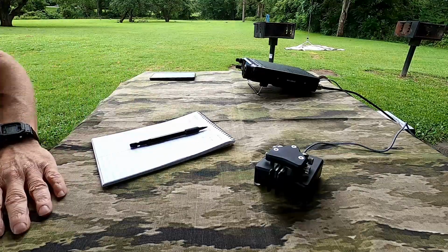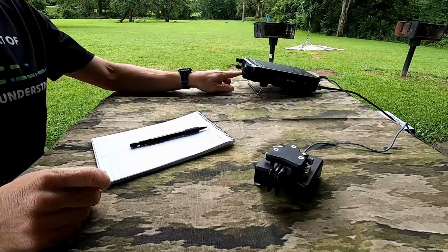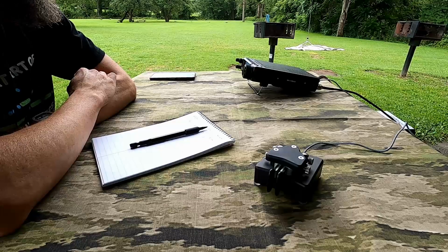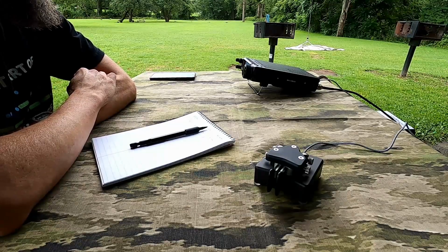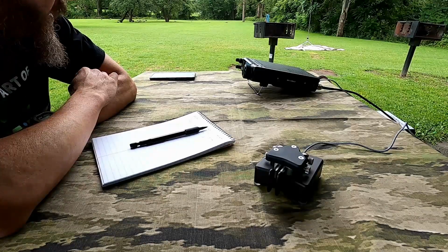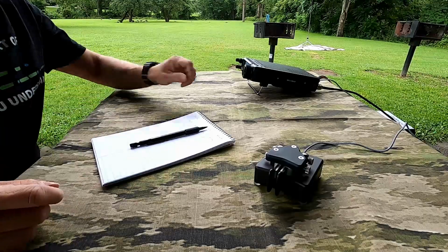Hopefully you can hear everything. Yeah, my SWR is about a 1.1 to 1 right now, and it was 1.6 to 1. Like I said, the wind blew that Faraday cloth over, and that made all the difference, which is weird. Okay, I just hit the RBN.